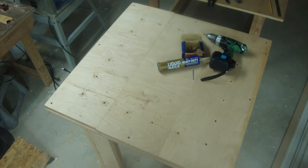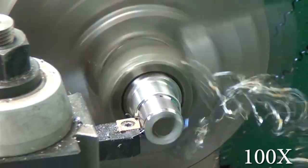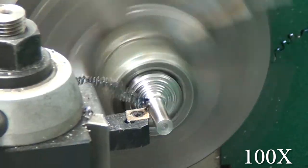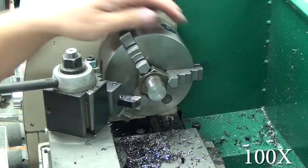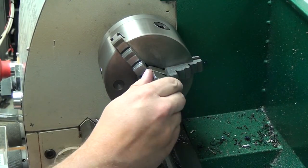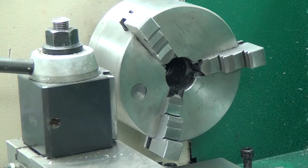The top is 30 inches by 30 inches and it's three layers of three-quarter inch plywood. I happened to have a bunch of plywood left over from a previous project, so I used nine pieces layered with liquid nails between each layer, then trimmed about three inches all the way around the perimeter to get it down to 30 by 30. I used screws to screw it down to the apron, and there was liquid nails between the apron and that bottom layer of plywood.